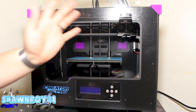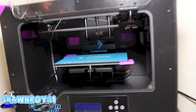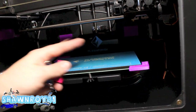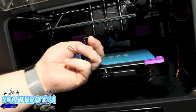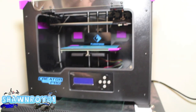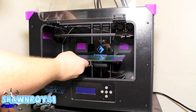Everything's all tied in nice and tight. We did leave that one corner piece a little loose so we can self-adjust for the plate. Unfortunately the 8x10 plate I got cut wasn't exactly 8x10. We tightened the FlashForge plate back there, spacers are in. Once we fire this up we have to do an initial bed leveling, but with the spacer in it shouldn't be a big deal.